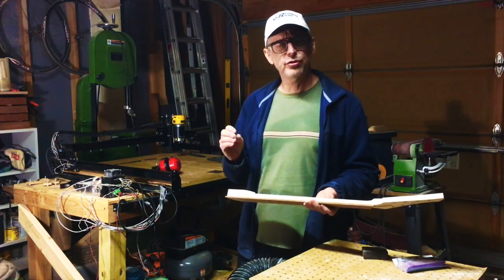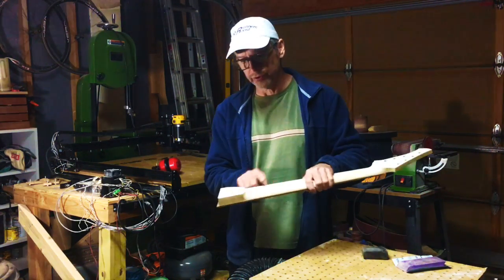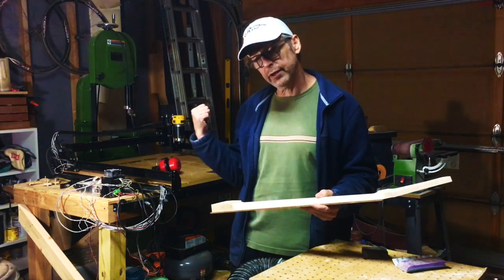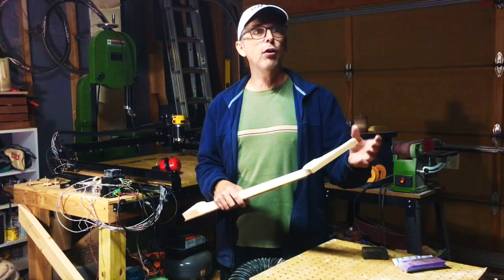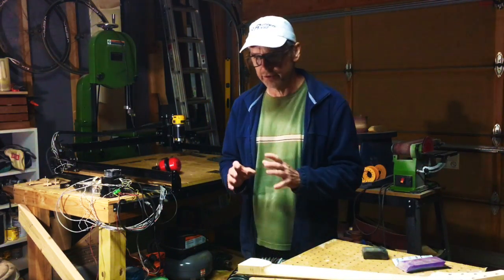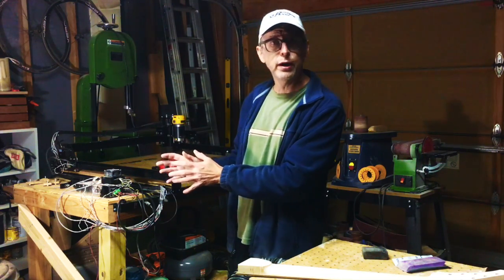So it didn't make sense to use that much electricity to make a neck. What I did was take a look at all the different processes I have to do to make the neck — the angled headstock, carving the contour, the shape of the heel, the truss rod slot, the fretboard, slots, and all that stuff. I came to the conclusion that there were certain parts of that process I could do with the CNC machine, but then other things I could do by hand or with power-assisted hand-building, ultimately meaning I could make a neck in just a few hours with less wear and tear on my neck, shoulders, and back. So every time I build a guitar, I think through the whole process and decide which parts to do with a CNC machine, which parts with power-assisted hand-building, and which parts entirely by hand.